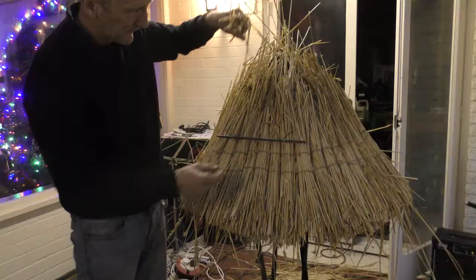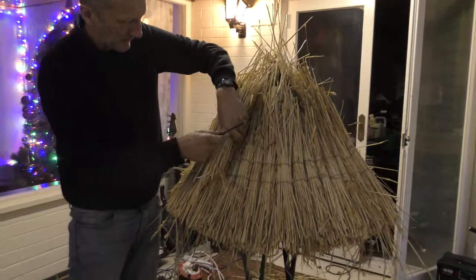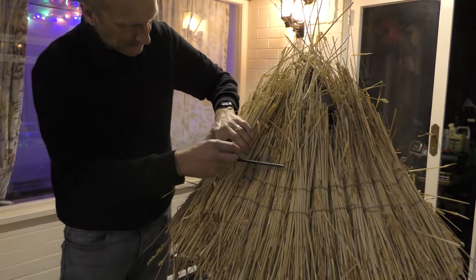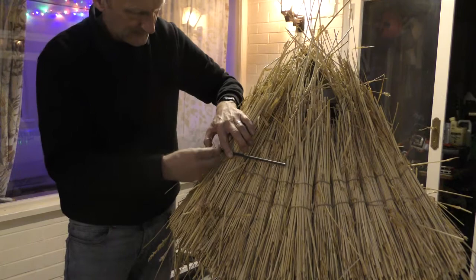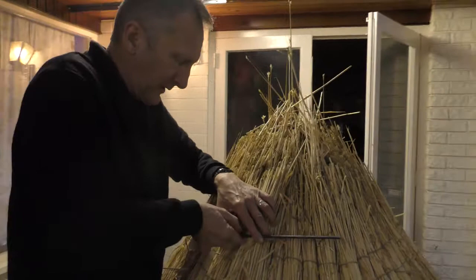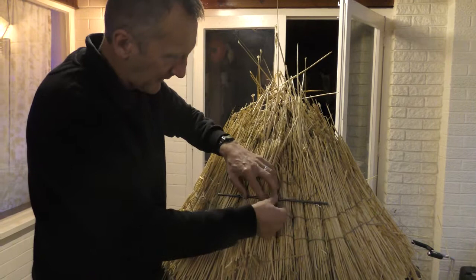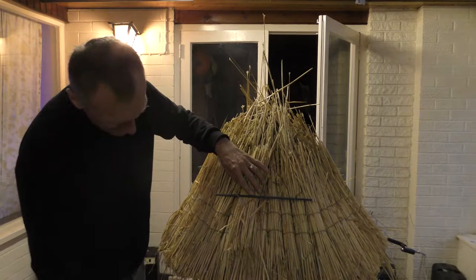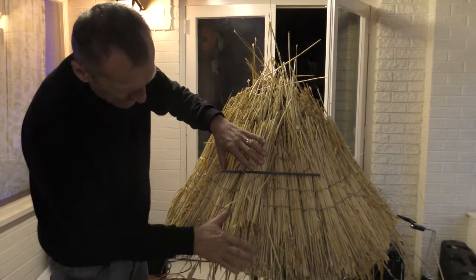Now I'm going to get some straw. Pull the sway back, pop the straw underneath, take it down — it's going to be about a third of the height. Just spread it out a little bit, then use the nail just to hold that in place and tie it round a little bit just so it's a little bit tighter. If I want to I can just cross them over temporarily just to hold the straw in — it's going to get tightened up a lot. But basically you're clamping that down really tight.